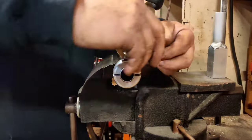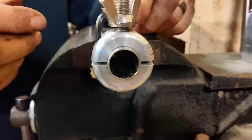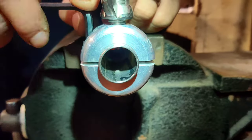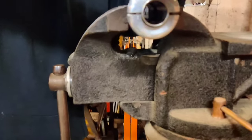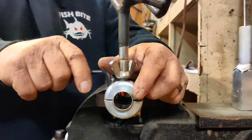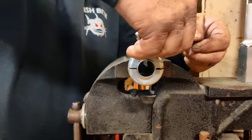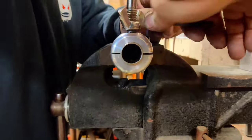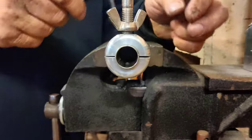Now I'm going to come back to the top and tighten this one. This is when you've got it exactly where you want it because you're locking this thing down, and it's not going to move. The key is that set screw. We started putting that pointed set screw in the bottom, and then we see competition also has started putting a set screw in the bottom of their mounts, because it's a great idea and it works. We'll shine a little light in there and you'll see that set screw coming up in the middle of that rail. When you take this mount off, you won't be able to see that underneath there unless you lay down on the floor of the boat and look up. But it'll really lock that thing. I want to tighten this thing up the same way I loosened it.